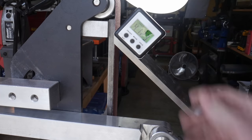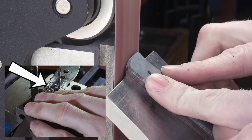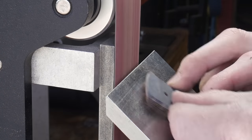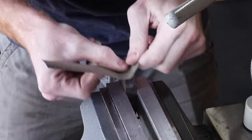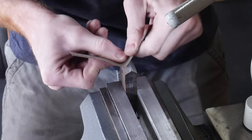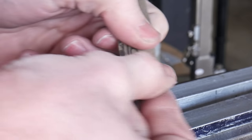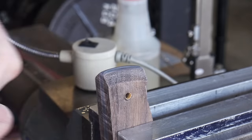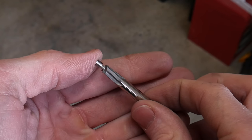At this point we address the front of the handle scales. When drilling the holes in the tang, I put some holes a little too close to the front, which limited my geometry options. I had to be very careful to cover those holes with the handle scales — it all worked out, but if I could do it again I'd want a little more radius on the front.